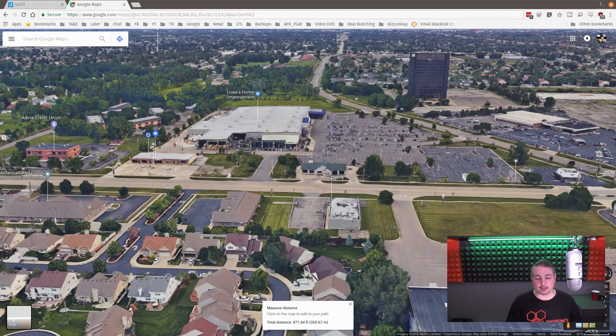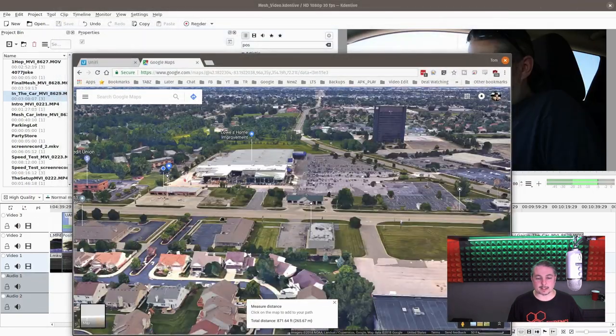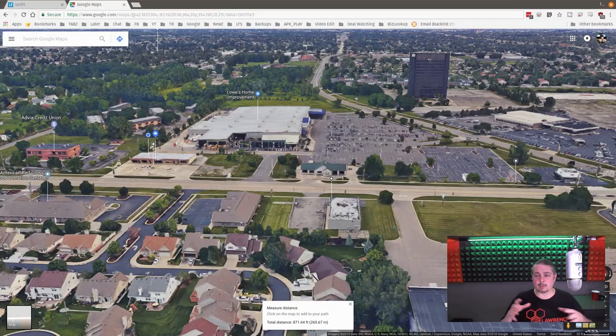Now this comes down to: which one do you want to buy? If you start with the Mesh Pro it has a little bit more power, more antennas, so more things can mesh to it and we were able to get better throughput. From a planning standpoint, they make a really good choice for the main primary units. They will also mesh with each other — we didn't test that because each one we're going to install will be hard-lined in.